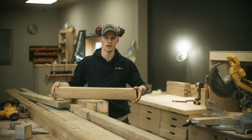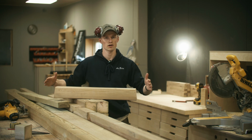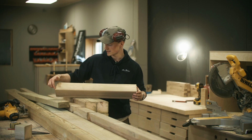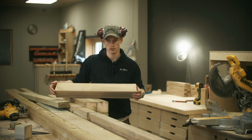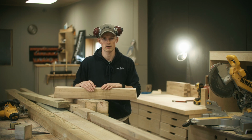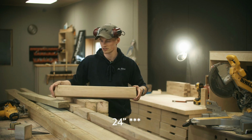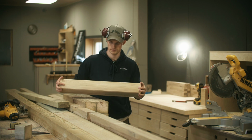So the stretchers, again, they have a 6.5 degree cut on each end, this time going in the opposite directions, making a trapezoid. And I've cut them at 70.6 centimeters between the longest points. You can cut them at 70, doesn't really make a difference. For you Americans, with your narrow 2x8s, you're going to have to cut them at 25.25 inches from tip to tip. You're going to need 2 of these.